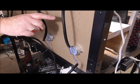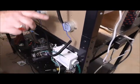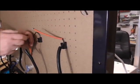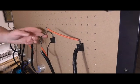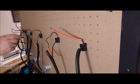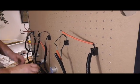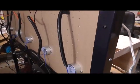We got the power wire coming from the junction box, and it goes up through this sleeve and will connect to the feed side of the switch, and they'll be soldered and shrink wrapped and put away and secured, and then we'll do the final connection.